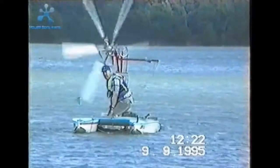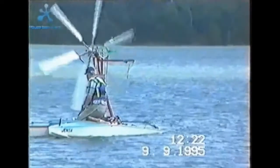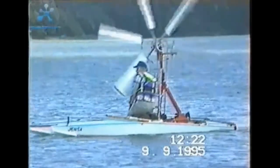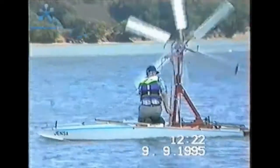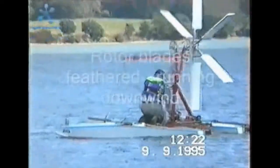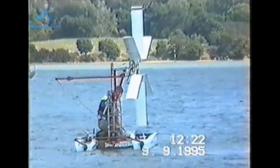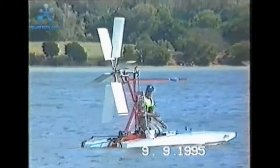The assembly therefore needed to drive when passing through the wind, with the wind from behind, doing this automatically. To control the wind rotor and stop it if needed, it was necessary to make a pitch control mechanism. Using this, I found that the stops and starts of the rotor were nearly instantaneous. Because the rotor trails behind the pivot point, the whole assembly weather-cocks into the wind automatically.